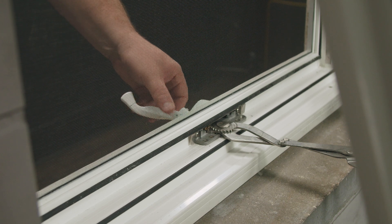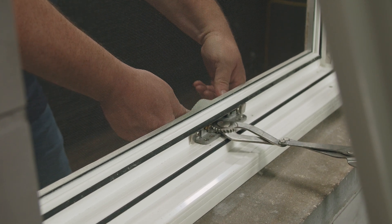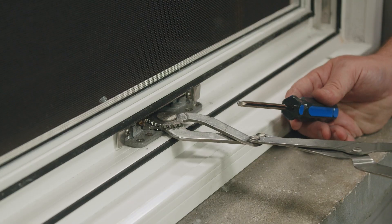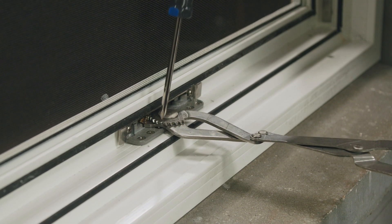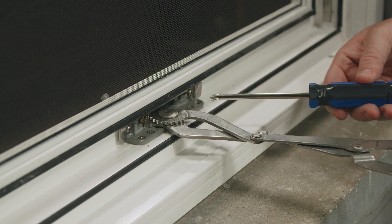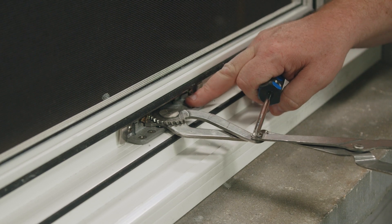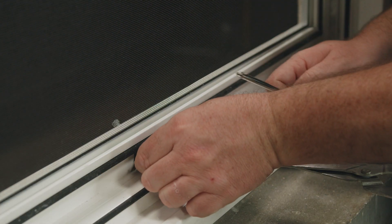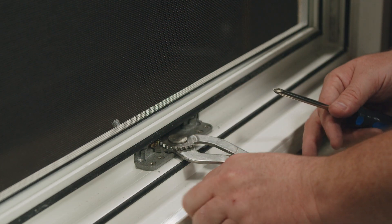From inside the window, I'm now going to remove the handle and unsnap the operator casing. The next step is to remove eight screws — there are six straight down into the frame and two holding the bracket. I'll begin by removing the two from the bracket and then the six. Use your screwdriver to prevent damage to any of the screws or frame.